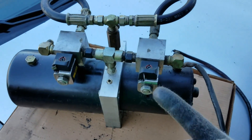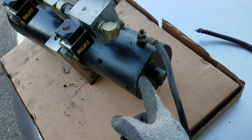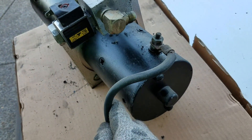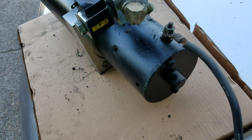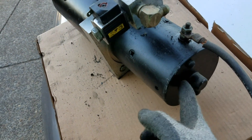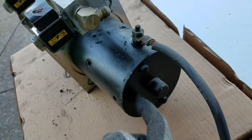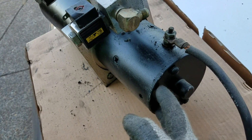In another video I'll show you different ways to do plumbing for one dump on a pump setup. One thing I do recommend on motors is — when you get new motors, sometimes they come with a cap that's completely solid with no vents. I do recommend you have vents on motors. Some people say they're not going to hop it, just lay and play and cruise, but trust me, you're going to get that urge to hop it. So when you get new motors, buy caps with vents. The vents help the motor breathe so it doesn't catch fire or smoke up and go bad.